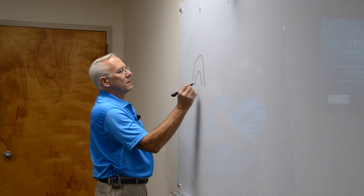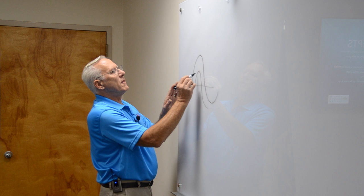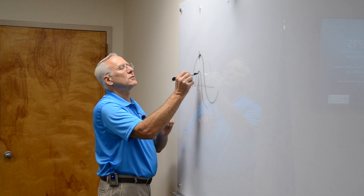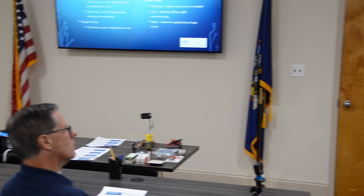In other words, they actually take the same phase and split it into two. If you notice the other one, this was over here. You know what I mean? This one, they're actually splitting this phase into two pieces, and that's how you get the 240, L1, and L2. Not that you need to know that, but you residential people call it two-phase. It's not two-phase. There's three-phase, two-phase, and split-phase.